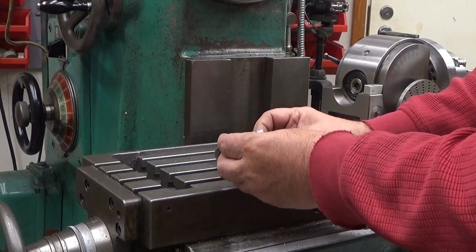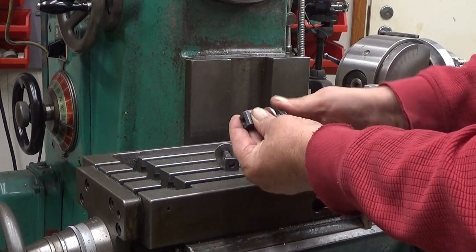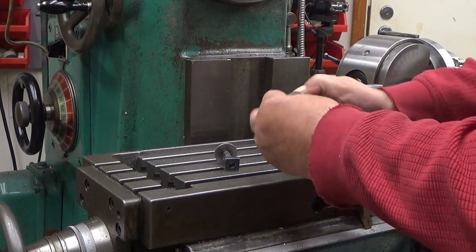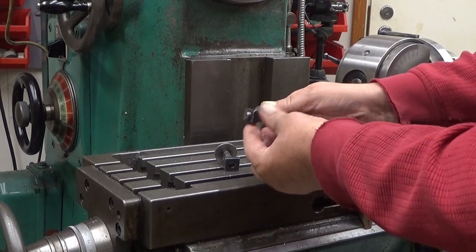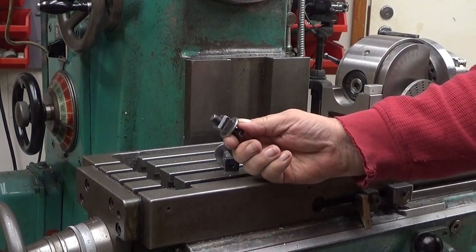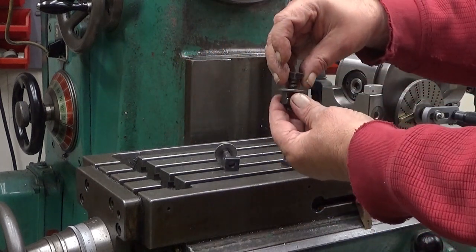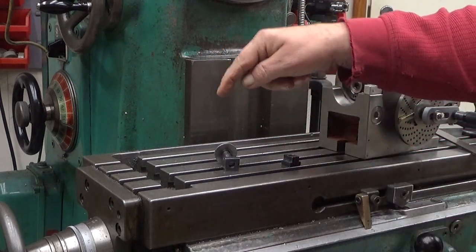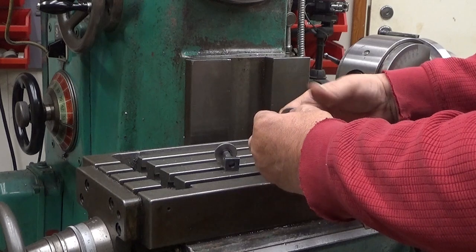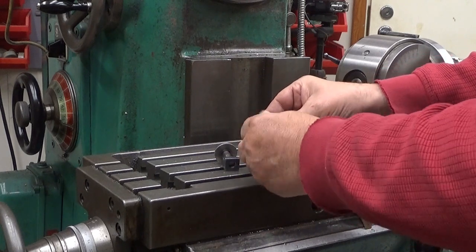If we take the one that I don't like, and if you put this bolt into it, hopefully it now goes there, you can screw it right through, like this, yeah? And now if you think about it, this would be sitting there on the groove and you didn't notice, you tighten it, you can break your table with this very easily, actually. So that's the reason why I don't like this type of T-nuts.